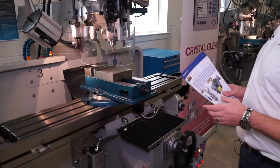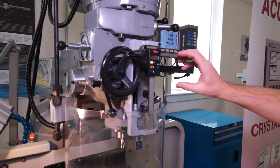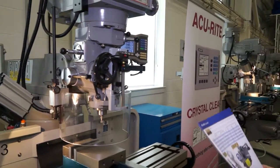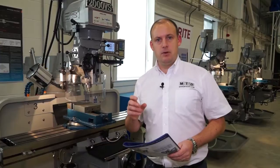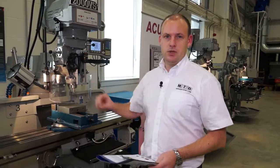On this particular model we also have a mill star, which acts as a positioning coordinate measurement system. If your Z axis was on the knee of the machine, you could use the mill star to position, find your position, or drill to a depth on the quill — giving you four areas of coordinate measuring.